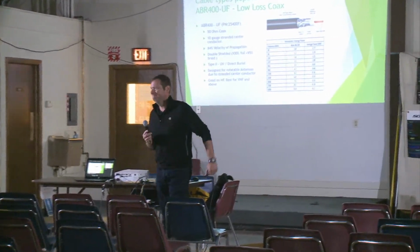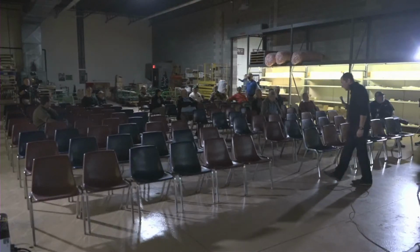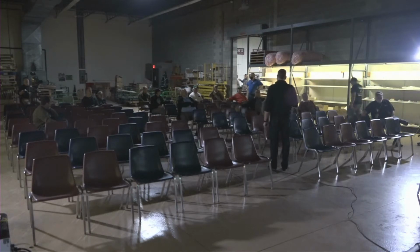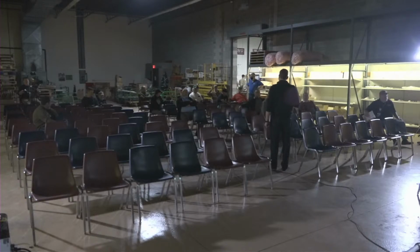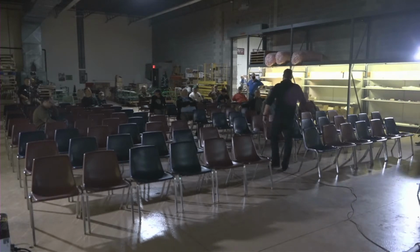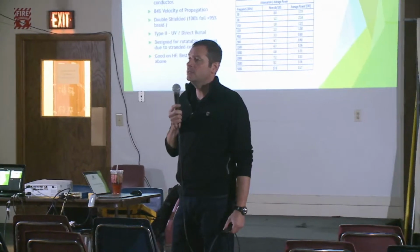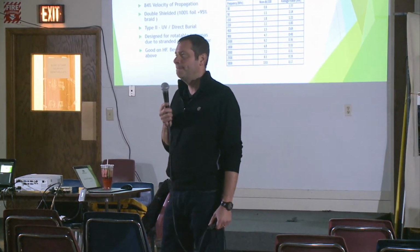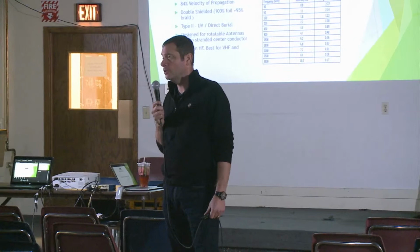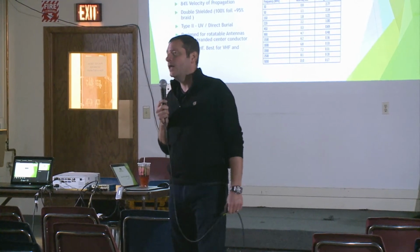You had a question, Victor? On the solid center conductor, and using it in a rotor loop. I've got one of my cables with a solid center conductor, and the other 3 that it's bundled with on the rotor loop. Does having it bundled with the other 3 cables give me a little better chance of that not breaking as opposed to it being by itself? It's going to depend on the angles, but if you're using a rotor and you're using a solid center conductor, the odds are that it will break down sooner than the stranded center conductor. 2 years and it's working, so.